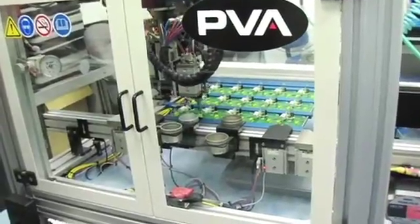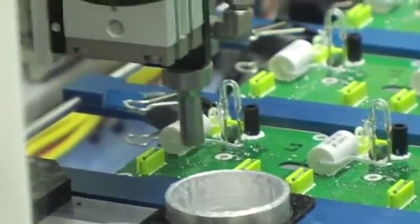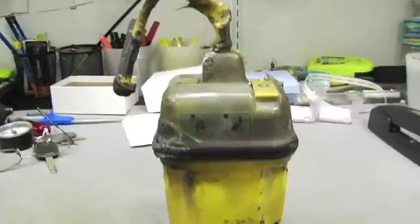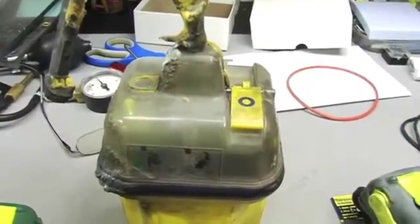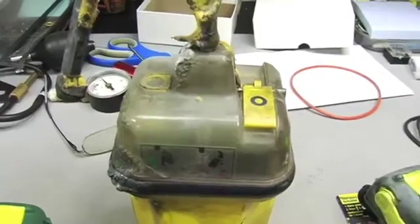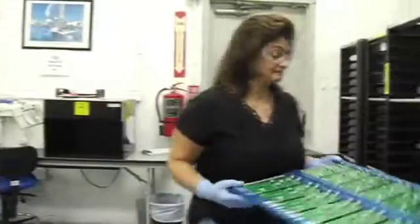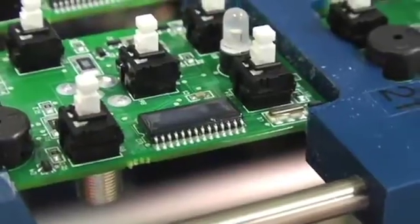The boards have been tested, tuned, and approved by quality. The next step is we conformally coat them in a layer of silicone — we spray the board with silicone and cure it in an oven. The value of conformal coating is that it protects the board from electrostatic discharge if the case should ever be compromised, protects the boards from water intrusion, and gives it a better chance of working in a crisis. It also preserves the board if it ever comes back to us, allowing us to inspect it and make these products better over time.